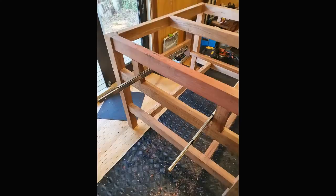The drawer itself is made from 16 by 240 millimeter pine and 12 millimeter hardwood ply obtained from a very popular hardware store. This is my first serious attempt at hand-cut dovetail joints, and I'm very pleased with the result. See pic 5, and there it is, 5 and 5A.